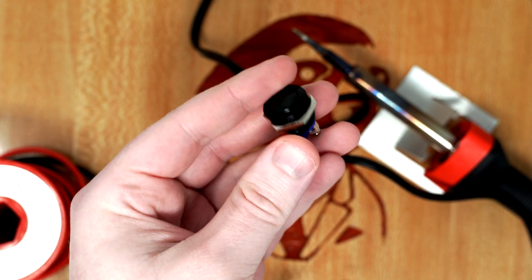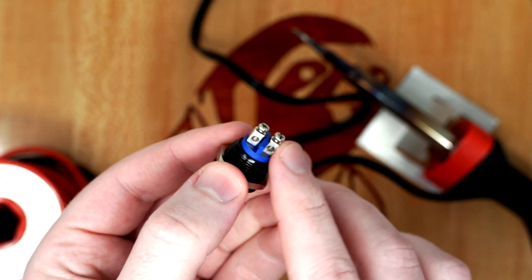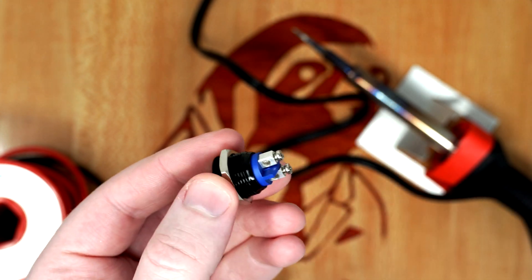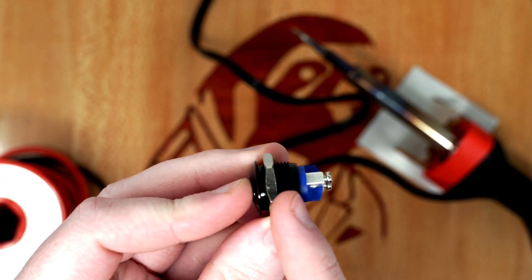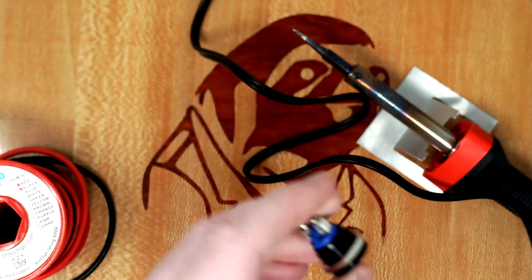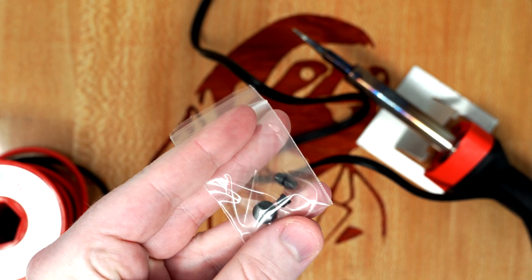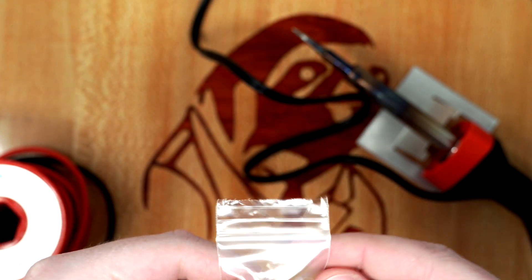You need a button. This is a 16mm dome top button. This kind has screws in the back, but there's lots of kinds that are much shorter that require you to solder the wire on. Either one is fine. As far as space goes, the ones that you have to solder are much much smaller. So if space is a concern on your build then this screw-type is not the kind that you would want to get — this might end up causing problems later just because it's so long. I'm using this smaller set — up, down, and select for the three holes here.